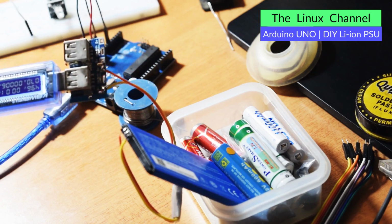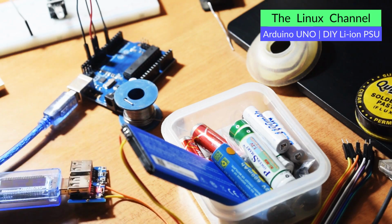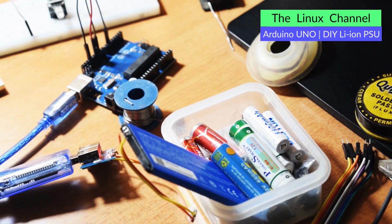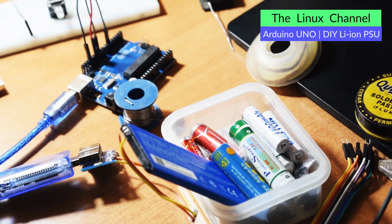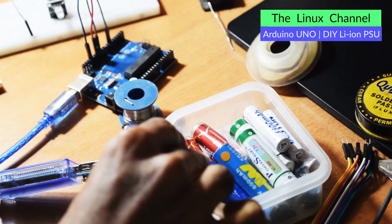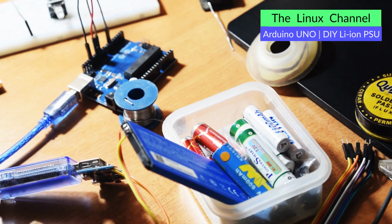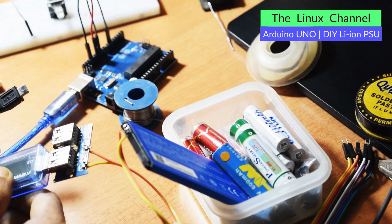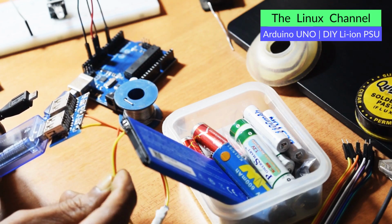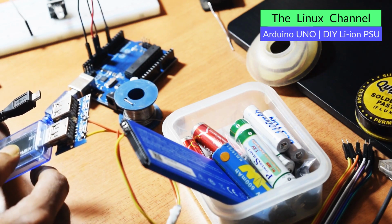It is not even 1 amp, and it is currently showing a voltage drop to around 4.97. I'm not sure about the charge state of this battery as well, so I need to see how much I can pull out of this. I need to be cautious so that I'm not pulling it all in one shot. I'm really not sure whether this cable can hold up. If not, I need to do some alternate arrangement, because it's quite a heavy current draw. If I pull around 2 amps, I need to make sure that this is not heating up at 5 volts.